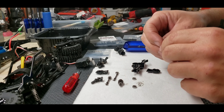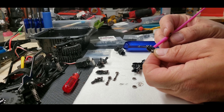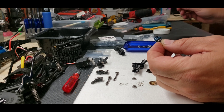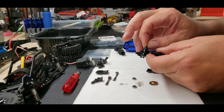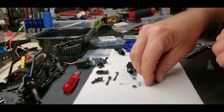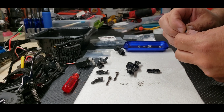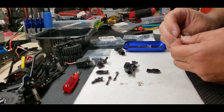First I am going to put this all back in and I'm going to grease this worm gear with some marine grease, which should in turn grease the gear below it. At least that's what I'm hoping for. Let's slide that in. Then we've got our side gear and these little bearings. Glad those slid in there nicely on their own.